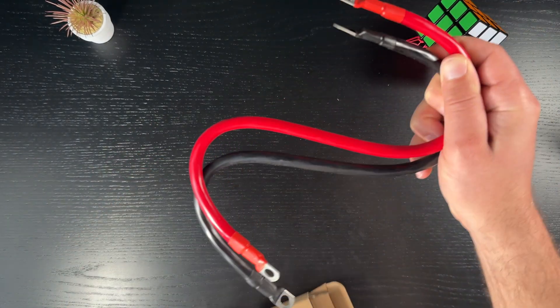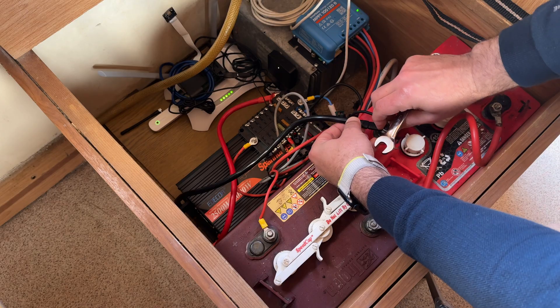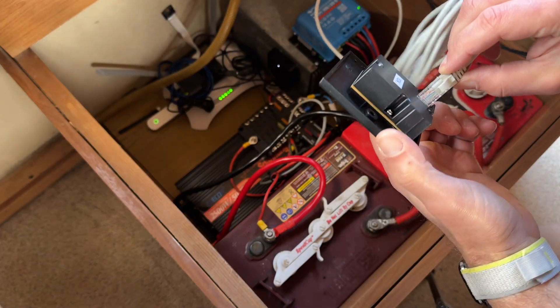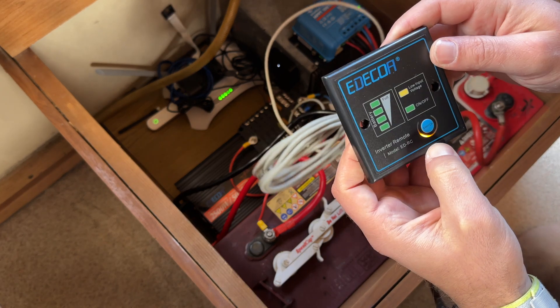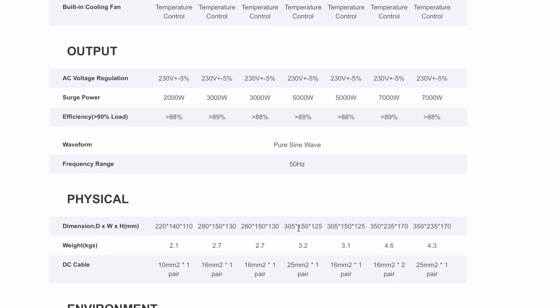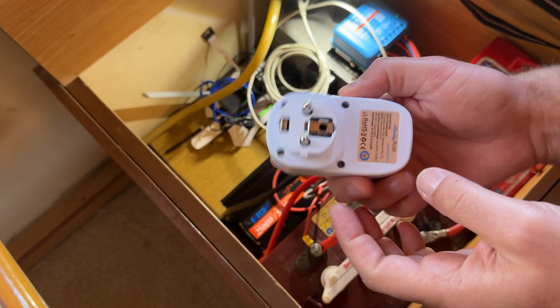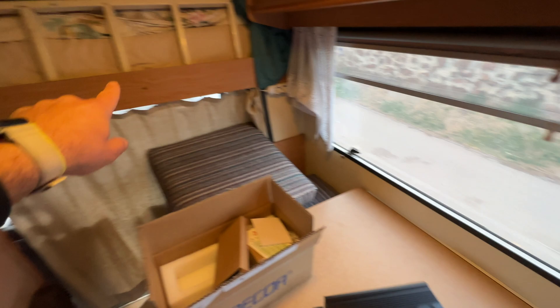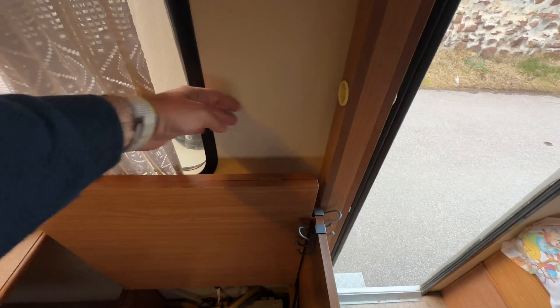To install the inverter, I also needed to find a suitable location since space was at a premium. I decided to mount the inverter as close as possible to the battery bank — a smart decision because the cables included in the inverter package are not very long. I connected the positive and negative cables from the battery bank to the input terminals of the inverter. It's important to use the correct gauge of wire for the current draw of the inverter to avoid safety hazards, and thankfully the Ereco included a good solid pair of cables in the package. My next step is to insert two smart plugs into the inverter to monitor consumption in Home Assistant and run a hidden cable to the camper kitchen.